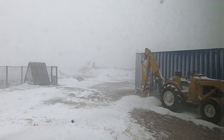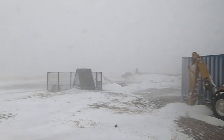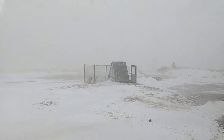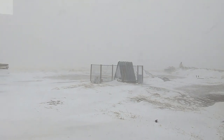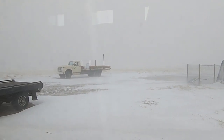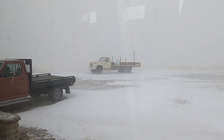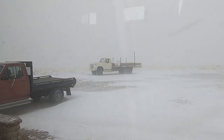Well, I figured out the problem. It's got a sticking float needle. I need to find a rebuild kit for this thing, rebuild the carburetor, and then I can diagnose it. So I'll have to do this another day. Nothing's getting done today.